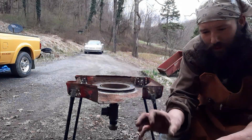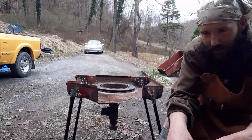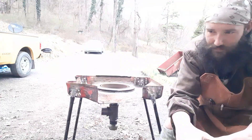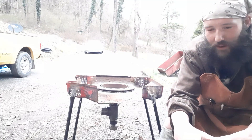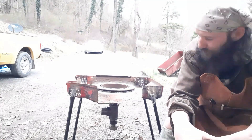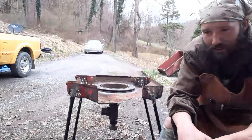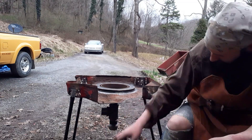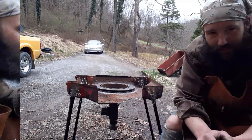Coming off the blower end, I just bought a ten-dollar hair dryer from Walmart. If you take those apart you can pull the motor out and remove the heating element. The motor and fan — if I remember correctly — fit right inside either three-inch schedule 40 or two-inch pipe. I can run that until I get my hands on a better blower. As I said, I wanted longer pipe nipples but these were the only thing they had in stock — a close nipple and a two-and-a-half.